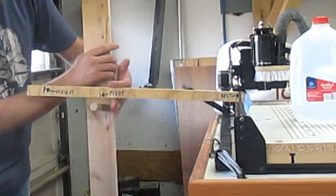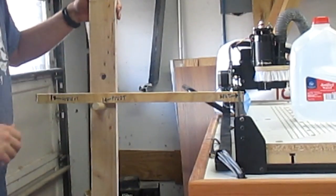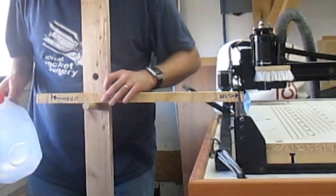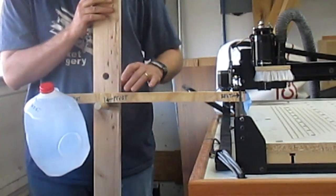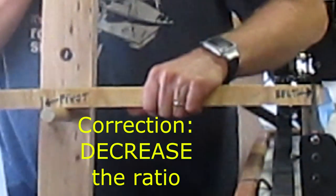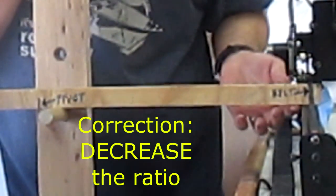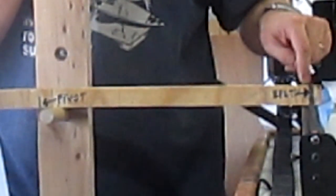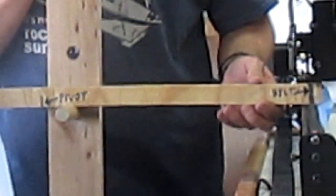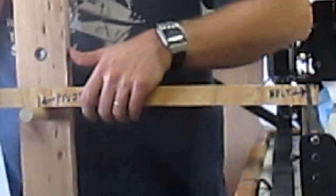I'm going to sit that where it says pivot. The height of these holes is dependent on your cart and the height of the X-Carve itself. Now I take my 8 and a half-ish pound weight and put it in here. If I have it tensioned correctly, this is not going to lift up on the belt. Right now, there is no gap between the plywood and the maker slide. Let's increase the ratio — moving the weight in an inch or so — and now there's a slight gap. Moving it in a little farther, and now there's definitely a gap; it's not even touching the maker slide. So basically, figure out what ratio you want, figure out what tension you want, and there you go.